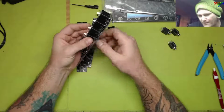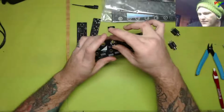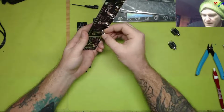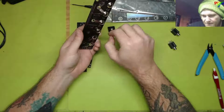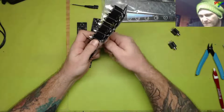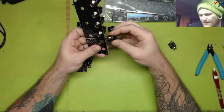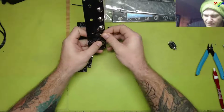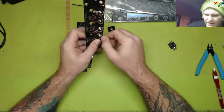And it's got a high point, a low point, and a wiper. And you can use the Arduino to control it, right? So you can also use the Arduino to see what the tuning is of an oscillator, right? Follow me? So you take the main Arduino, that's the one that's telling you what tune you're in on your first oscillator, and it takes the tuning straight off of it from, I think, the ramp output, and that's how it gets its tuning. And then it outputs what the tuning is.